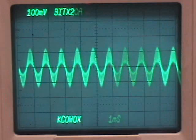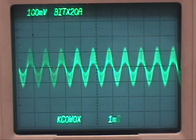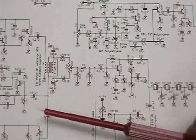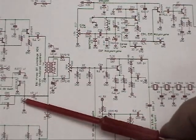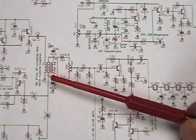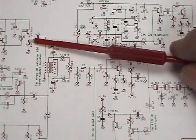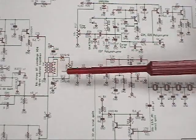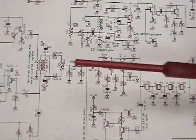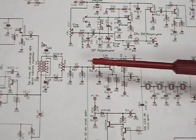We've plugged the crystal back in, so you can see the difference it makes when it's out of the circuit. We've verified the voltage coming up from our mic amplifier — it's going into one section of the modulation transformer. The beat frequency oscillator signal is coming down here; we checked it right on the top of this resistor. Those are being mixed together in the balanced modulator. What the balanced modulator is going to do is generate new frequencies, and being a balanced modulator, it's going to reject the carrier.